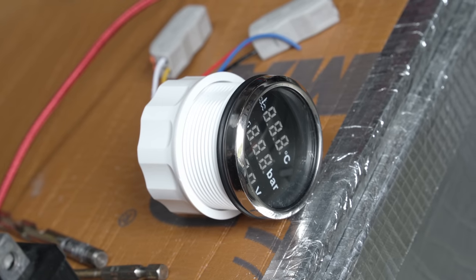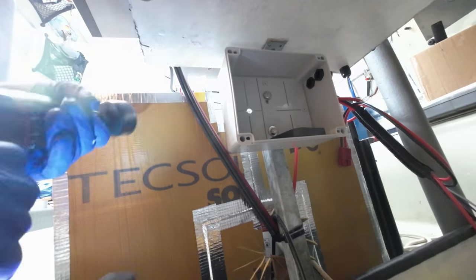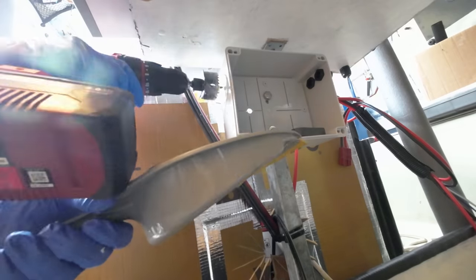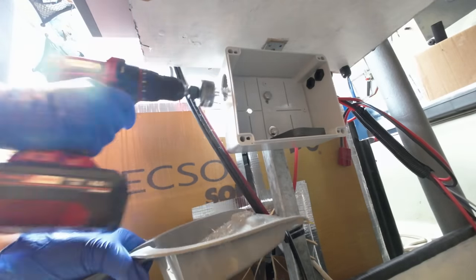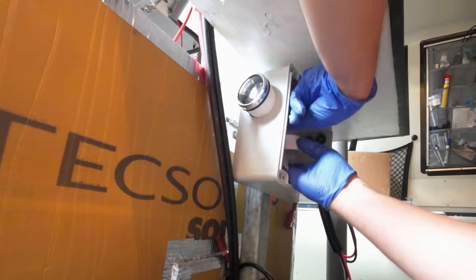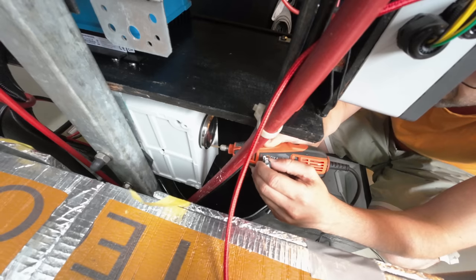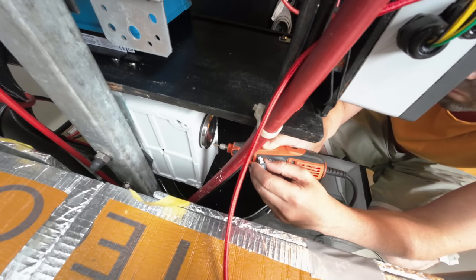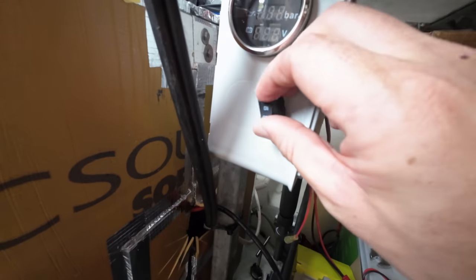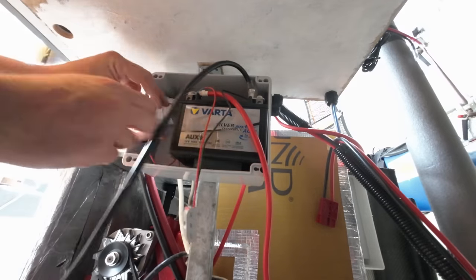Alan did not come from the factory complete with many engine instruments or gauges, which I thought was a little measly. So I've got this - it's an all-in-one water temperature, oil pressure, and crank battery voltage meter. Space needs to be made for it, out comes the hole saw - after I spent about half an hour easing out a plug of fiberglass jammed in the saw from a previous hole-making extravaganza. The meter fits in neatly and can be screwed into place, but there's one final hole to make. I don't want the meter running permanently as it's an LED, so here comes a rectangular on/off switch and the Dremel to make space for it. It clicks repeatedly, which is a wider indication that we're on the right track.